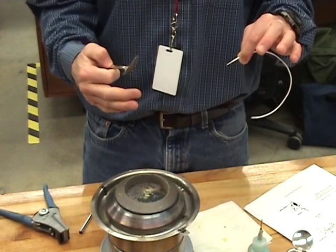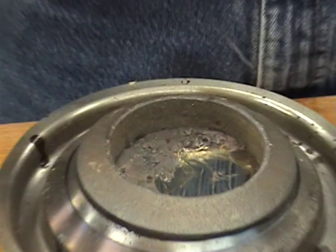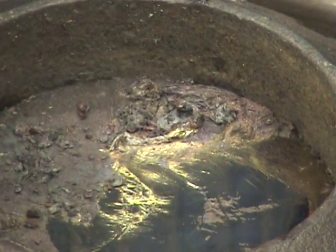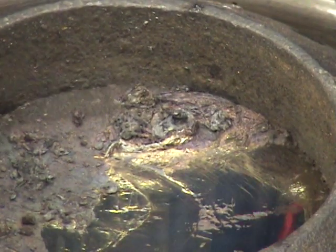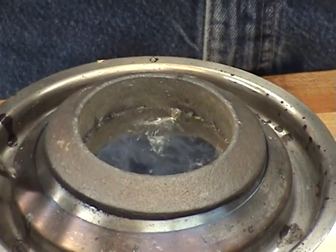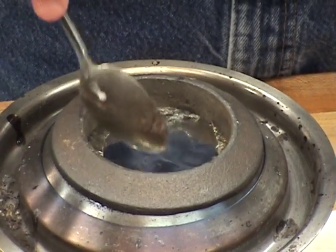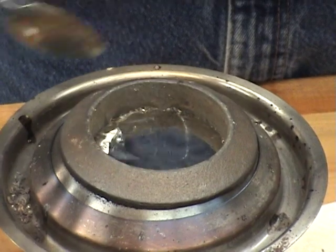Then on top of the solder pot — I don't know if you can take a look at what the solder pot looks like after sitting here for a few minutes — dross accumulates on top of the solder. You do not want to stick your wire into that mess. So the first thing I'm going to do is clean the dross off. I clean it, remove it, and just put it right here on the tray. And it immediately begins to form again. This may be too hot; I might have to turn it down a little bit. But I'm going to give myself a nice clean area.